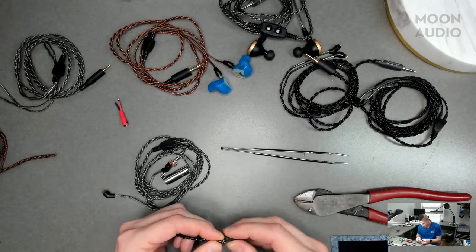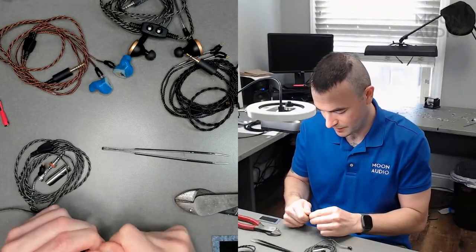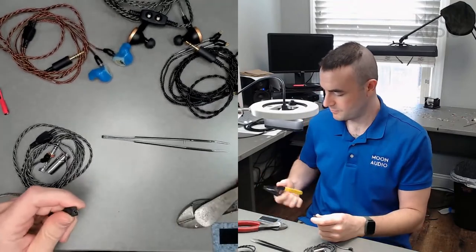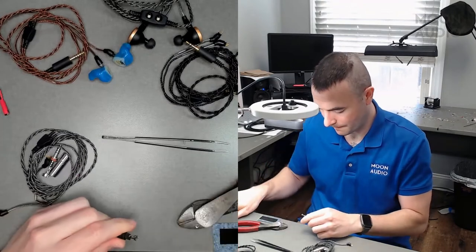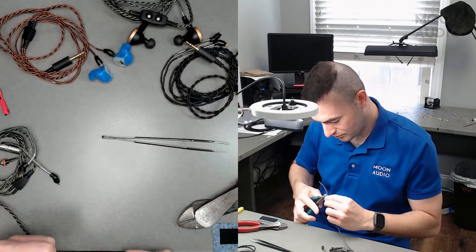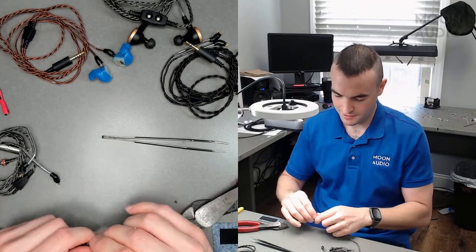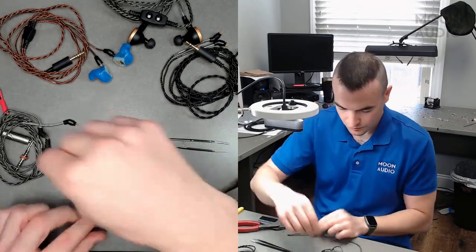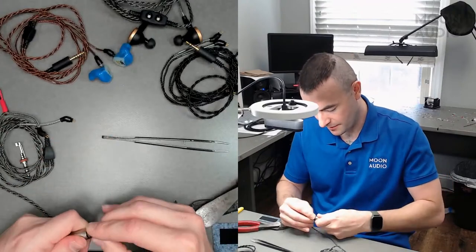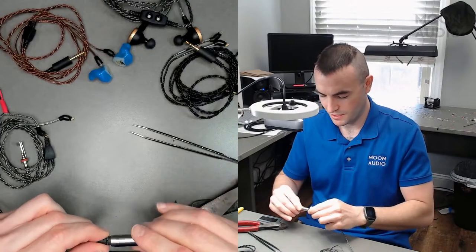Let's get started here. Cool. It's always fun to get the grommet on, but once it's on, it's not going anywhere. So what exactly does that grommet do? Strain relief. Gotcha. So it provides a good kind of stiff flexibility to the back of the... Can you show it to us a little closer? Yeah. There you go. Okay, gotcha. And the diameter is tight between this and the cable, so it's got a snug hold on the cable. Now I just trim that grommet enough to get it into the back of the connector. There we go, got a tight fit there.